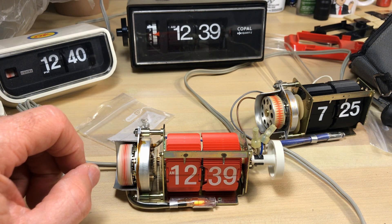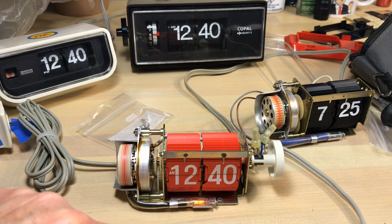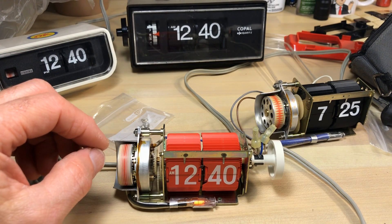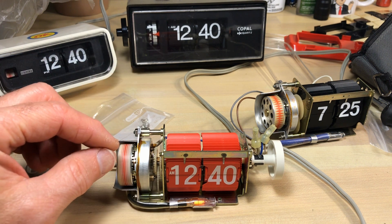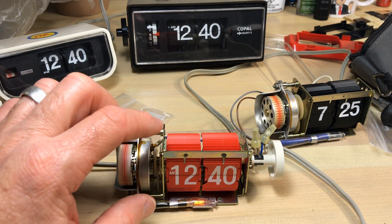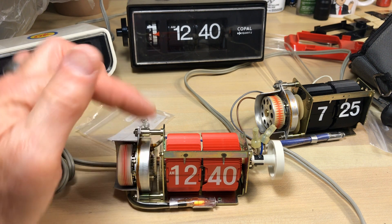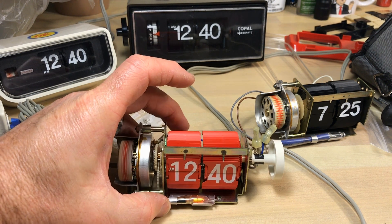It's running at about 120 volts. There's concern there — you think, well, this is rated 100 volts, what's that going to do? This is not sensitive equipment. The bulb may be overpowered a little bit, but it doesn't even look like it. The motor may be overpowered somewhat for the windings, but I'm wondering if that motor is any different from any of the other motor windings. It's operating fine. Now, how is that possible? It's rated for 50 hertz — it needs 50 hertz to keep time. These clocks use the frequency of the alternating current to keep time, so this shouldn't be working correctly. It shouldn't be matching this clock over here — which it is. Really cool thing I found on this motor: there's actually a switch.